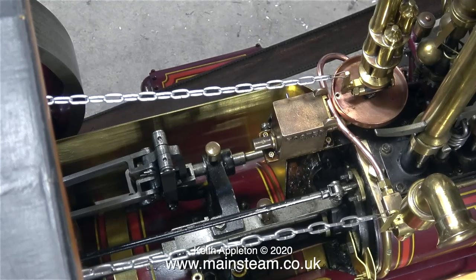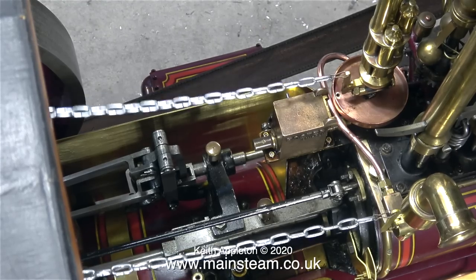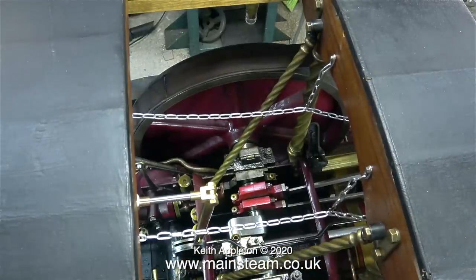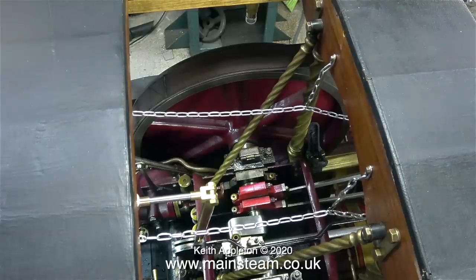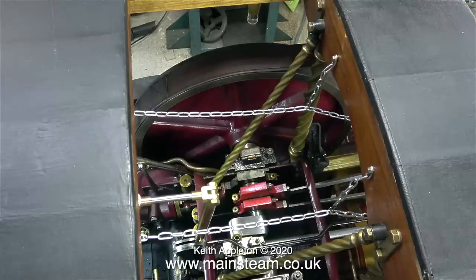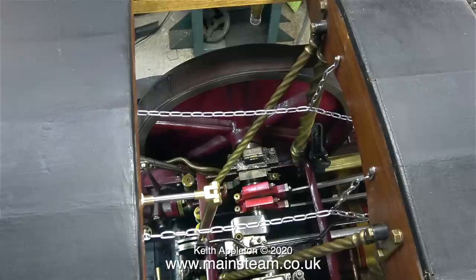While the paint was dissolving I thought it was a good time to refit the whistle with its water trap and reattach the chains to both the whistle and the siren. Notice how the chains are supported midway along their length — I've done this for two reasons. One reason is to stop the chains from falling into the motion should they ever break, which to be honest is very unlikely because the chains are very strong. The main reason for these short links though is to support the weight of the chains.